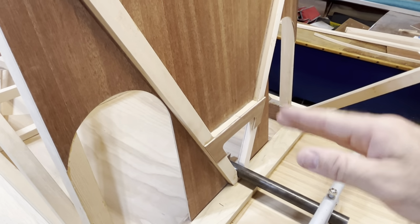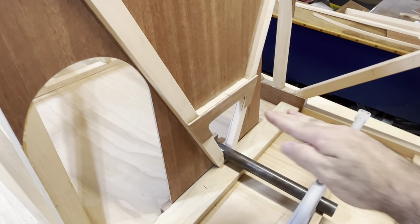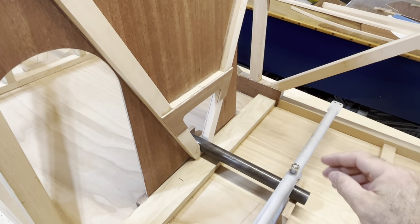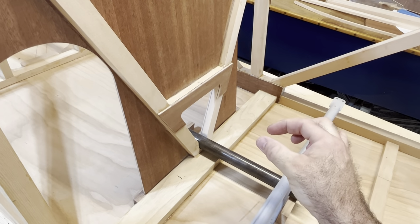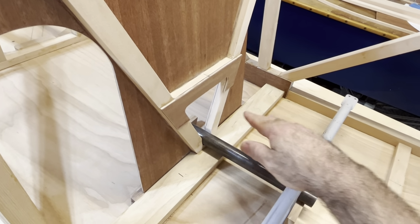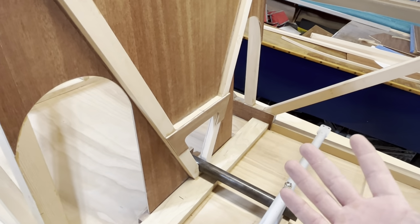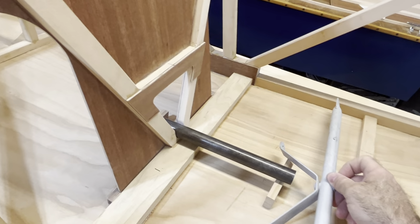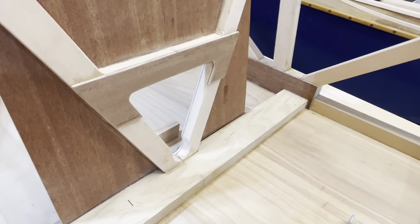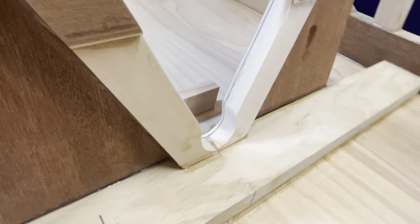The problem is, because they come in and meet, and clearance is needed for the top torque tube for the front pilot's pitch, those two pieces coming together didn't leave clearance for this to sink down low enough to fit the way I felt it should. So what I did was I notched out that V and turned it into a semicircle for the torque tube.